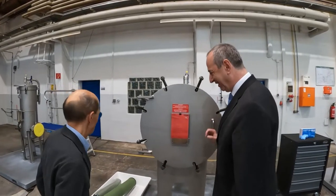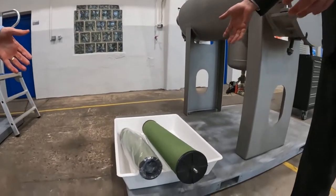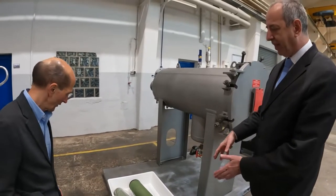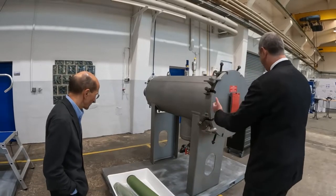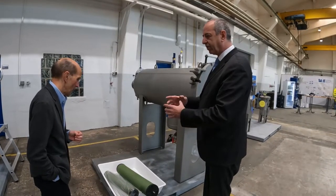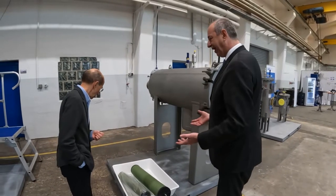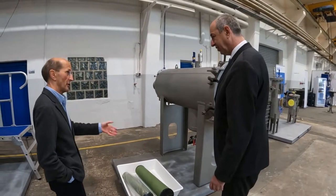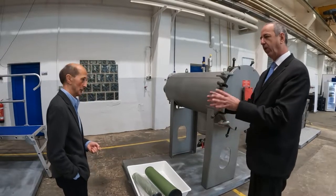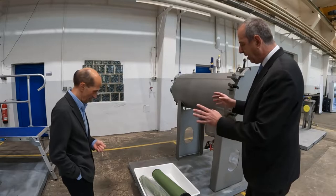Here are some tools we found helpful — we have a drip tray where we can also do separator testing. That is something we also want to make clear to people: you need to be prepared. It's not just good enough to open it and say 'oh, what am I doing now' — you need to be prepared. We're also going to have some other drip areas where you can dry the separators and the coalescers, which we show in our test rig. We have all the equipment for people to do the real thing. The wet-type testing is done in one dedicated place, keeping things cleaner and safer here.